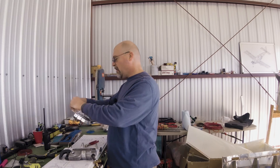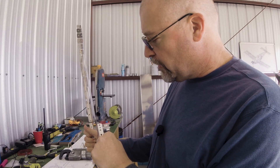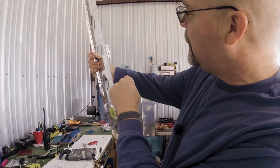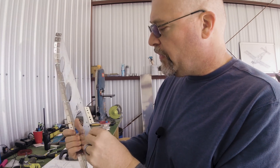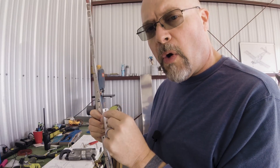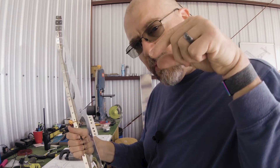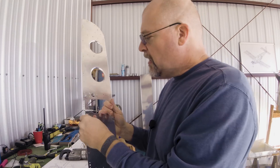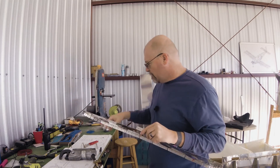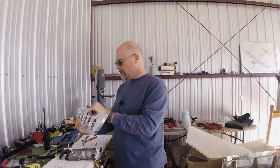You know what? I need to widen that hole. Every once in a while when you do nut plates, the hole needs to be widened. You put the nut plate on the bottom and usually it'll tell you to size up the hole. But sometimes if you look down the hole to where the nut plate is on the back end, the skin can get in the way a little bit. What I'll do in those cases is make the hole the nut goes through slightly bigger. It doesn't hurt it, and it makes it so that when you put the nut in, it clears the metal and bites on the nut plate behind it.